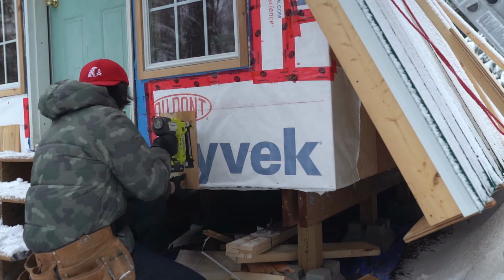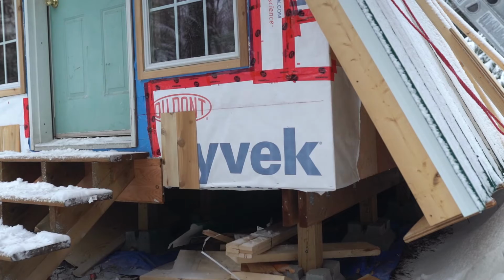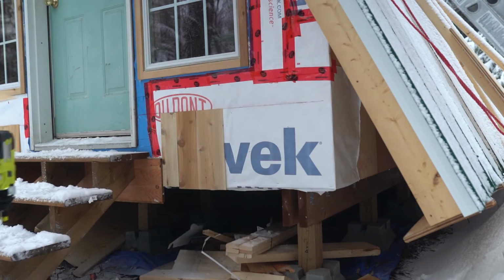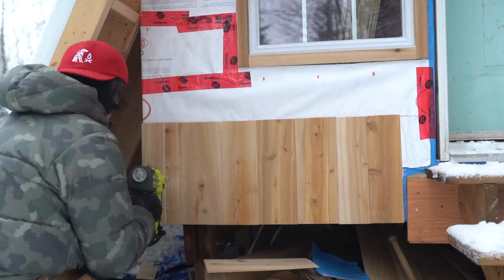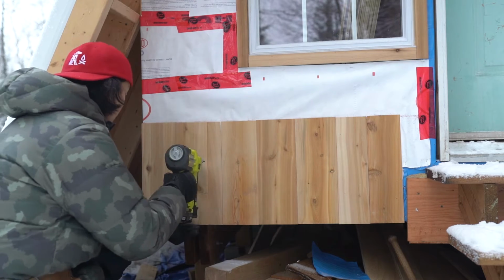A couple things differed from my process compared to what you'll see classically in these Bob Vila videos. It's not just one square area that I'm putting shakes up to, because it's shifting and going upwards. The idea of a storyline almost didn't really work for my cabin. Essentially what I did was start with the bottom row. I would put down one set of shakes, then another set of shakes. Those were my starter strip. And I'd put down another set of shakes over top of that.